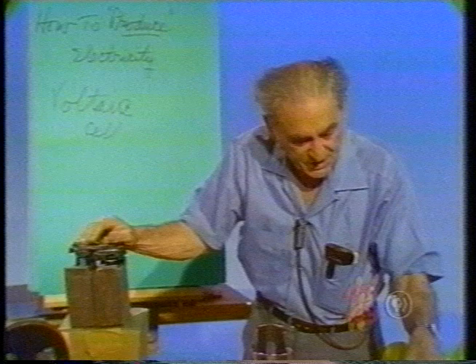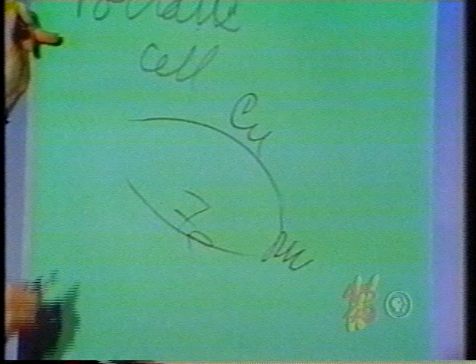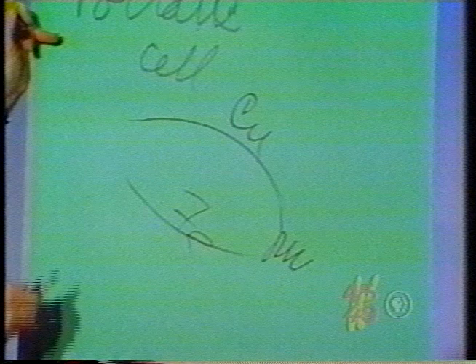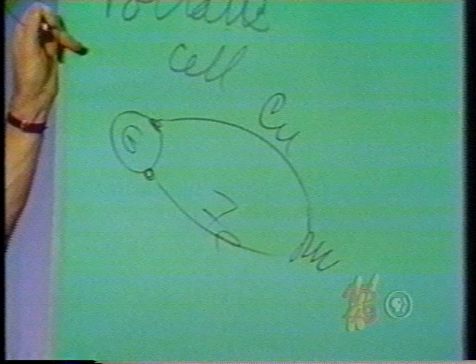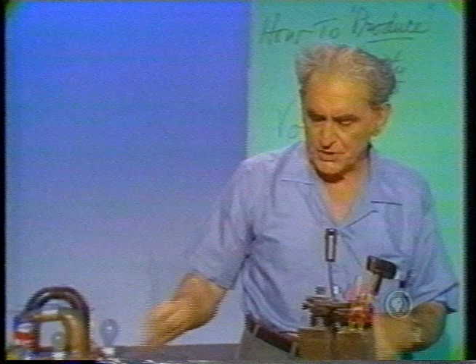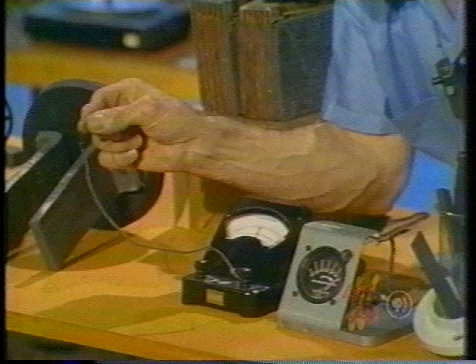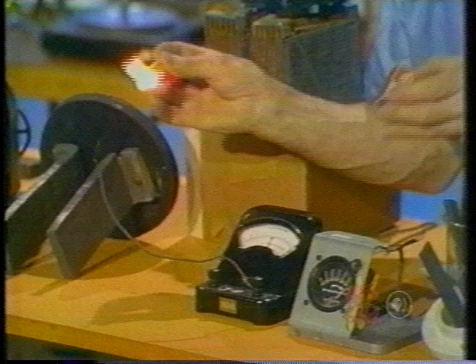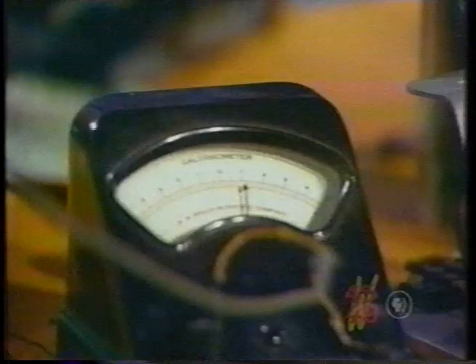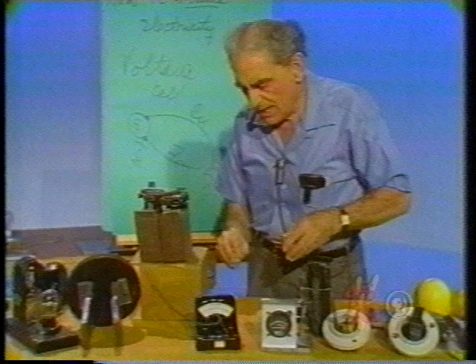A voltaic cell produces electricity. How else? Let me take two different kinds of wires — let this be copper wire and this iron wire. Let me make the ends in one junction, and let me connect the other ends to a galvanometer. Let me make this junction at one temperature and this one at another temperature. What do we have? A thermocouple. And it produces electric energy; it gives rise to a difference of potential. Here I have two different wires connected to a zero-center meter. I'm going to warm this junction — I heat it with a match. Watch the needle. There it is. A thermal EMF — an electromotive force due to a difference in temperature of the junctions of the thermocouple.